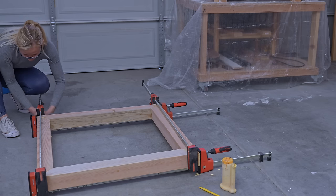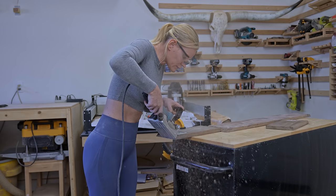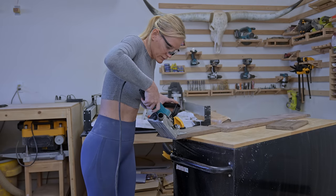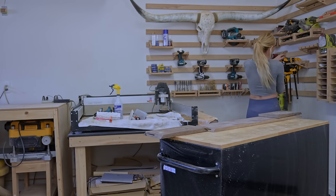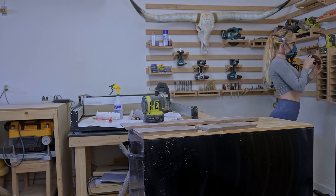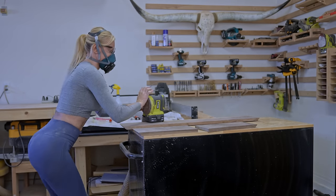As for the walnut accent table / bench, I will connect the pieces with my biscuit jointer as well. I've built a similar bench in a previous video in more detail if you'd like another video for the process. Click the link above or in the description below. And now it's time for a little bit more sanding. I started with 120 grit and worked my way up to 320 grit.